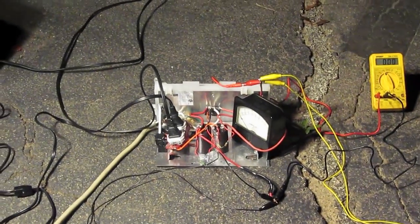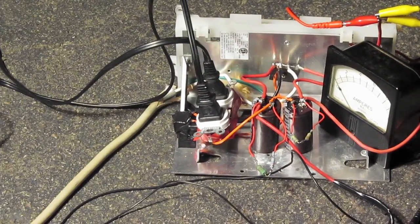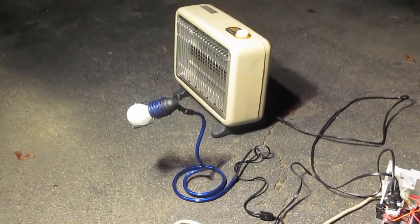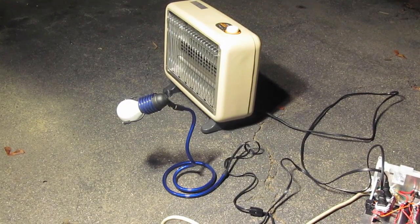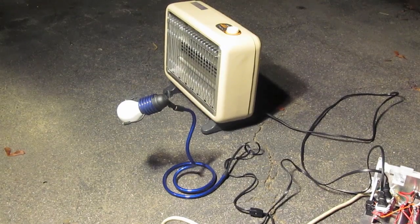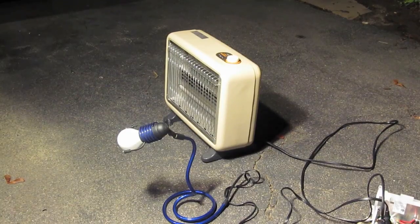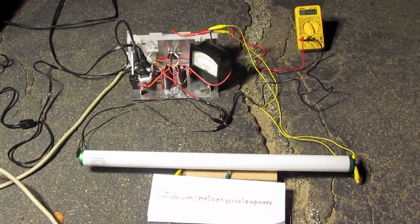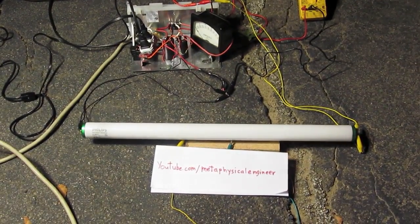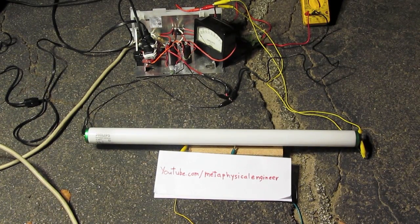I have my DC kill rig. I've added a couple of plug sockets, and if you follow the cords over, I've added some resistive loads. We have a little spiral lamp with a 60-watt light bulb in — that is the low setting. Then we have the space heater, which has two settings: high and extra high. Those will limit current input to the rectifier, and then the rectifier will function as a voltage doubler, feeding the tube far more voltage and current than it was ever designed to handle, hopefully resulting in meltdown.